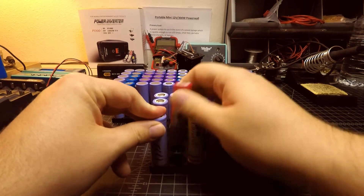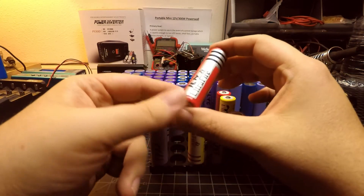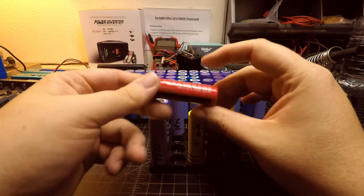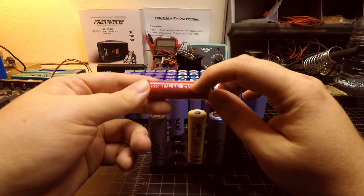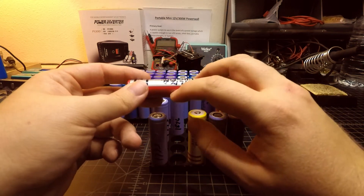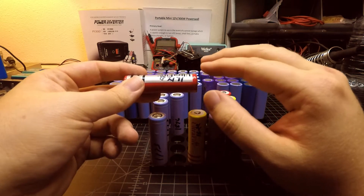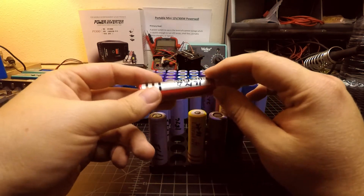Laying around the house, I've had these red label and yellow label Ultra Fire 18650s as well. I've had these for several years and used them to power flashlights. These red wrappers were rated at 3,000 mAh, and when they tested, they actually tested out pretty well at 2,191 mAh on this cell, and the other one tested out somewhere in the same vicinity. So these tested out at my target 2,200 mAh, which was great.